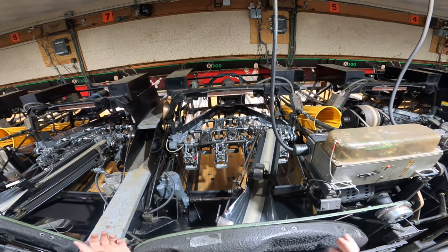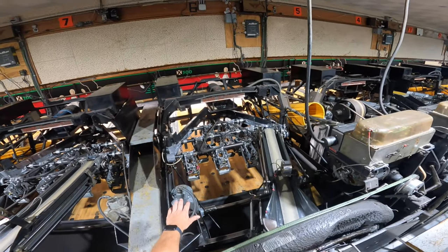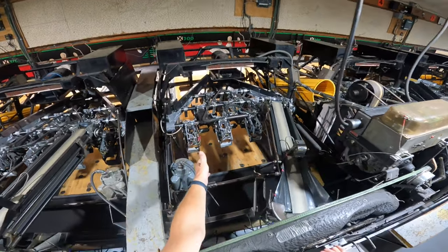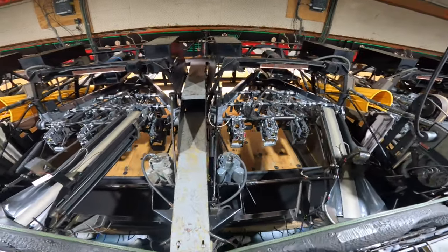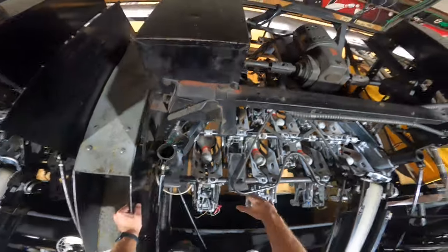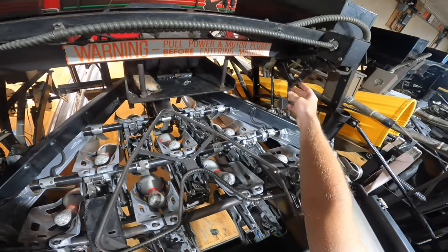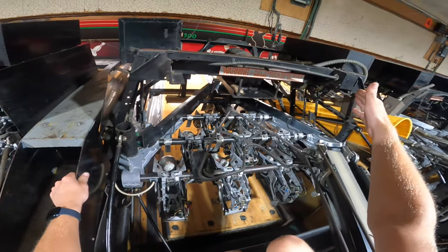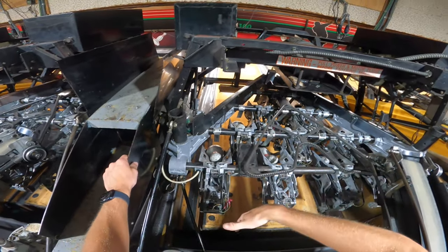Obviously when the table goes down on first ball, the cups stay in the up position, because the respot cells are attached to the back and that's how it picks up the pins. However, when it's spotting pins, all the pin cups are on these tubes, and when it spots pins there's this little latch right here that pops out with a solenoid, and that lets the cups go in the down position. There's a set of gears on the top that articulate that.